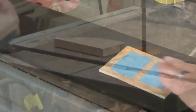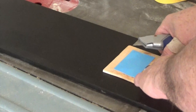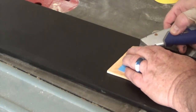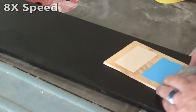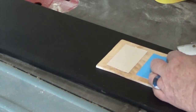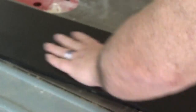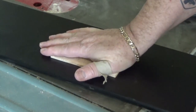Look at that figure — that's pretty stuff. This is double-sided duct tape I got at Walmart. This stuff is sticky, it works great. This is too thin to reliably run through my drum sander. It's pressure sensitive — the more you push it, the stronger the bond. It's flat, it's melamine, and I trust it. Stick this down there and now we'll go to the sander.